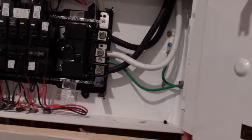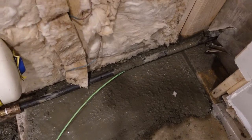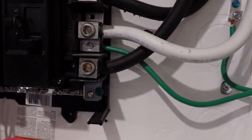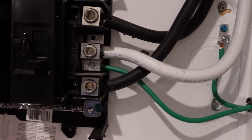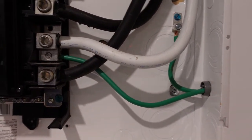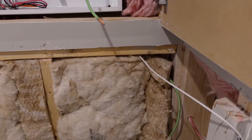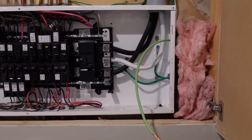Here in our neck of the woods, we've come through with the ground wire — you can see the water line is now polypropylene and the ground is now copper. We're going to run that up and into the main neutral on the mains of the service entrance, which is 200 amps. This is the first point of attachment and this is where it needs to go. We've re-routed our wire up through the wall and got it into the main compartment.